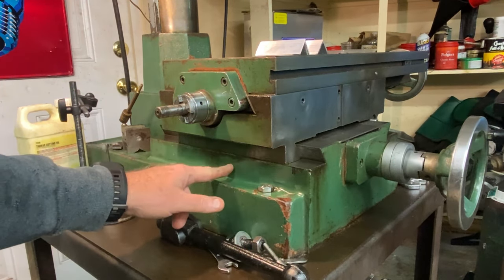I ended up tapping this side in, but when you do that you have to come back and re-square it — which is again what I was talking about before: you move one thing, you've got to move another and go back. Right now we're coming up on about four or five thou on the negative side. Getting closer — probably two or three too much. I'm almost there. I'll keep working on this and come back when I get as close to dead nuts as I can. I get maybe a thou — that's close enough. That feels good for squareness to the top of the table too. Now I'm going to sock these down; to do the in-and-out alignment we mess with these brackets, not the fasteners themselves. That's the beauty of this thing.